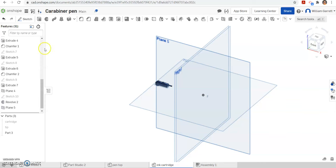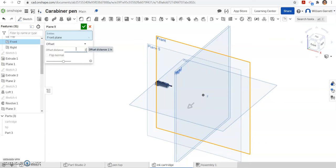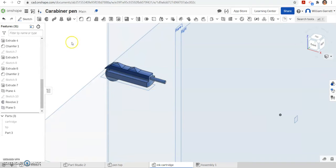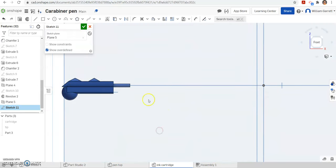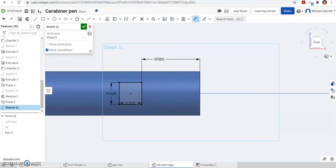Next I am going back to the ISO view and adding a new plane. Hit plane, select the front, and place it 0.038 in front of it. I am going to use this to do the little grippers on the tip of the slider to keep it inside the ink cartridge. Start a sketch, select plane 5, and go straight to the front view. I am going to sketch a center point rectangle, zooming in and centering around this line. We want it going 0.025 in both directions — 0.025 by 0.025, so we are making a square. Dimension from the base to the first edge: 0.065.